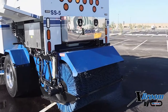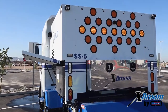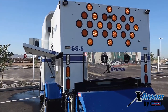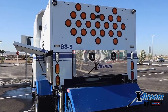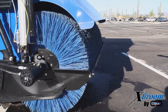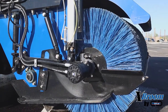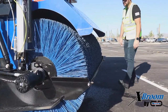Moving to the rear of the truck, there are a couple more components to look at. Inside the cab, we do have a feature that will run a test pattern on your arrow board. Turn that on and inspect every light — make sure you don't have any that are burnt out. It'll run through and cycle every single light. Make sure that these are tight and that you have good tension on your end slides. This is made to be adjustable so you can move it in or out — helps with trailing. Make sure you don't have any damage to your tie bar, that it's straight, and that all your bolts are tight.